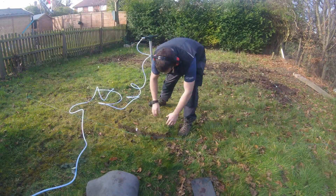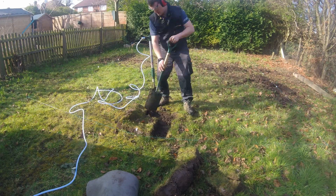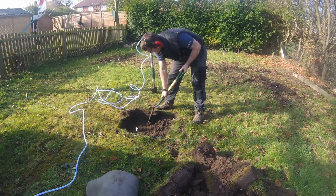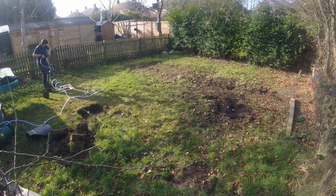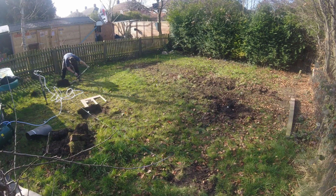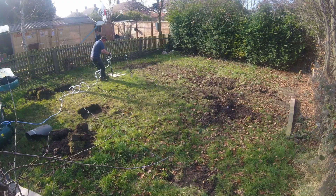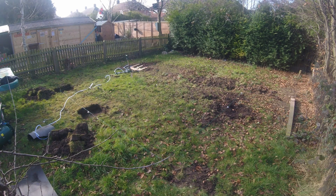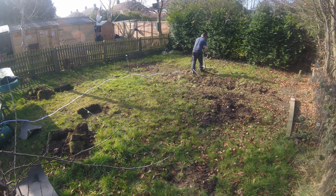I'll fill each of these holes with hardcore and then use 7.3N concrete blocks to get the whole thing level and raised up far enough from the ground that I'm not going to have a problem with splashback. As you can see, I've made a really simple template from some scrap ply I had lying around. It just means I can get some neat holes and I don't have to measure each one out every time. I did just use the pneumatic spade to dig around the edge.